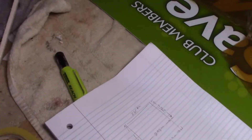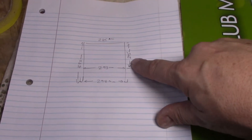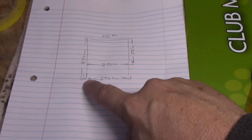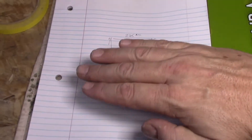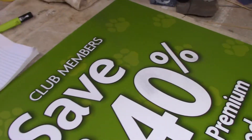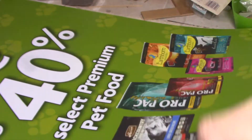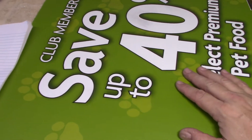So right now here are the basics: I've got to start laying this down — 285 across the back, come up 275 millimeters, then 293, and from the back all the way up to the leading edge where the wing mounts roll under, that's 330 millimeters, and that's 298. So I'll set this all up on this board and this material I got from work is about the same thickness as what I'm putting on, so this will give me a good indication of how everything's going to fit.